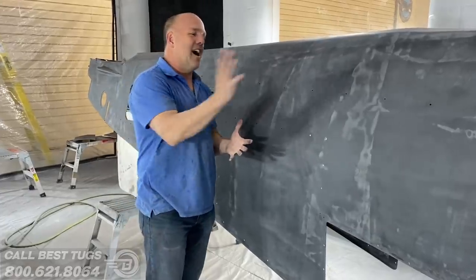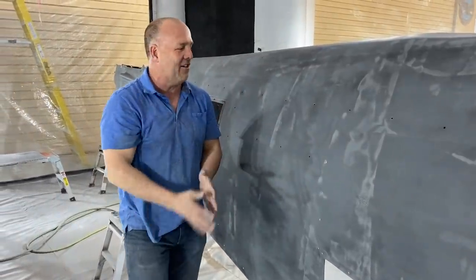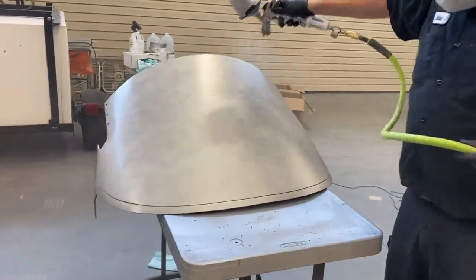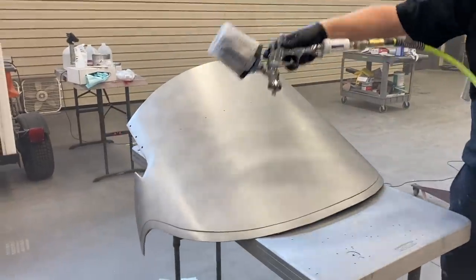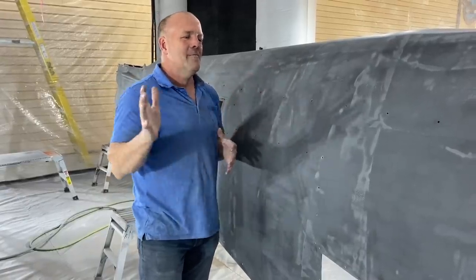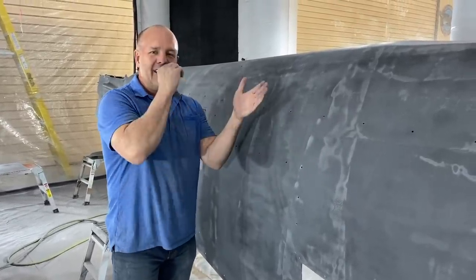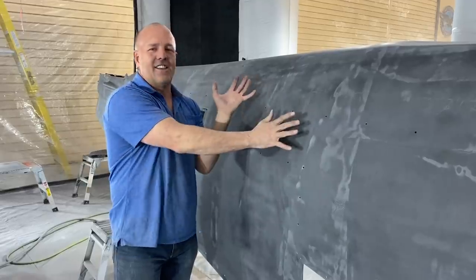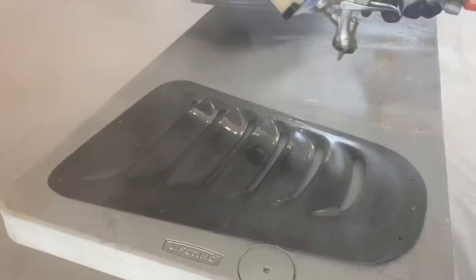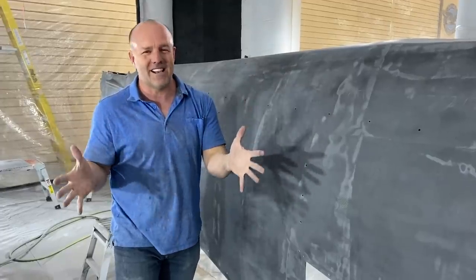And then you go through and block it down, and then there's still a few more pinholes, and you do it again and you block it down. So normally you use a lightweight spray-on filler. Super easy, it's like Christmas when you get to do that after you've played with carbon, trying to keep it clear. The lightweight spray-on filler, you just sand down, but you can't use that because it's got a color and you'll hide the carbon. So if I want a clear carbon, I actually have to use carbon resin to build out and sand back. I don't know if that makes sense.